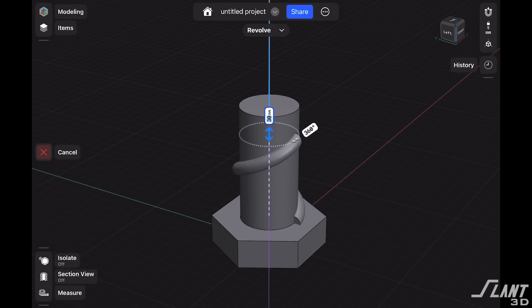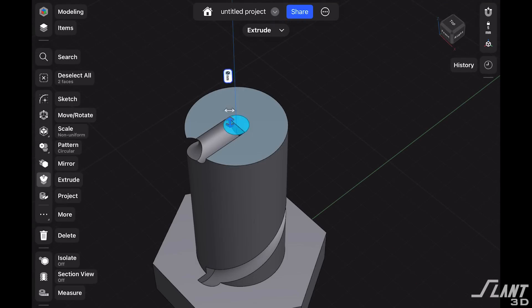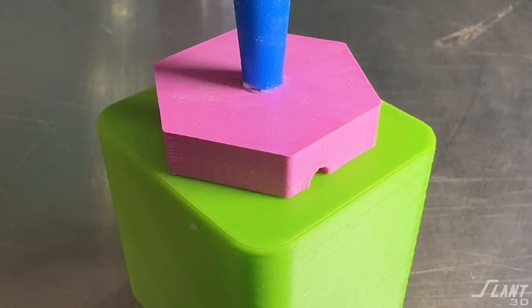There's one more version of this. With all these previous designs, once the part has been inserted and the glue slots are down there, there's no place for the glue to go. You can make this more complex and interesting by adding a spiral to the outer side. This gives you a single continuous channel, so you don't have to worry about one channel getting all the glue and others not getting any. This twisted thread improves the part's strength with full-length glue adhesion throughout. You shoot glue through the main bore, it goes to the bottom of the bolt, then travels up the spiral and comes out the side. You know the entire area is fully filled when glue comes out the side, giving reliable feedback to machine operators during final assembly.